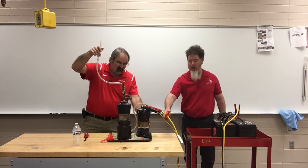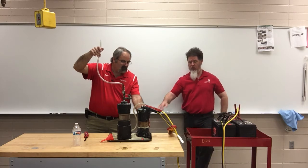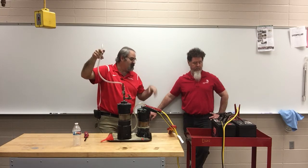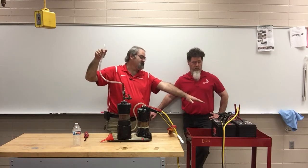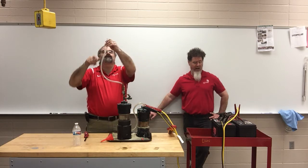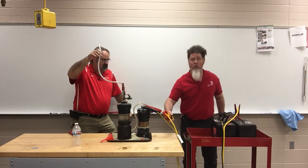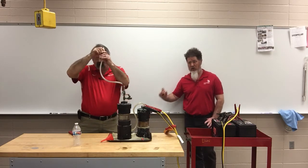So our battery pack is just older batteries. The batteries are wired like you would see a golf cart wired — they're wired in series rather than parallel — so we're actually getting 24 volts as opposed to 12 volts. It's actually closer to 25 volts. Two batteries wired up in series to get enough voltage. At 17 amps we are producing a little bit of hydrogen, but just a little and not a lot.